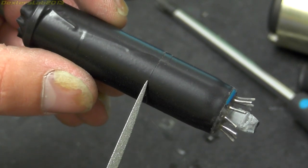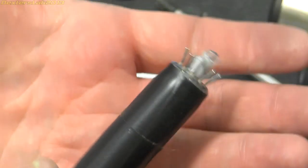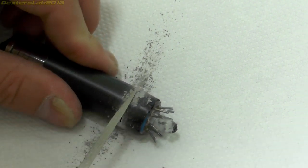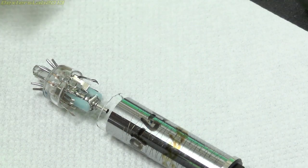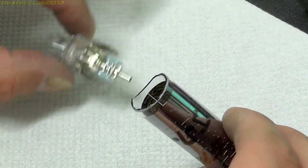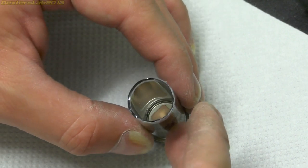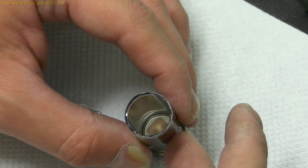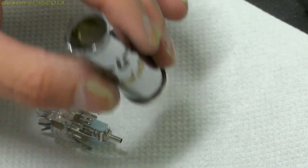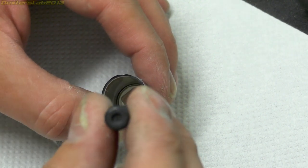I put black tape around the tube so if the glass breaks it keeps it all intact. Here we can see the Saticon tube in pieces — it doesn't go very far into the tube; it is really just an electron gun. Down in the base of the tube you can see the actual imaging surface — a sort of gold-coppery coloured surface. That is selenium, arsenic, and tellurium. I'm not really going to mess around with that too much — just poked a hole through it, so that is a very very fine surface in there.